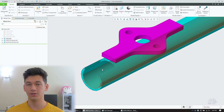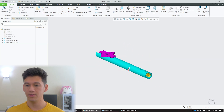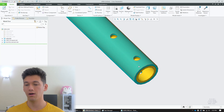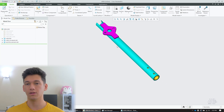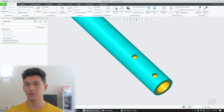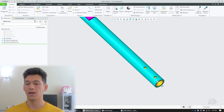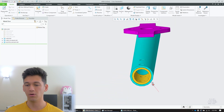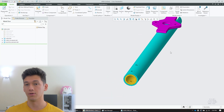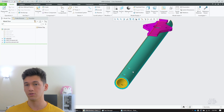The reason for this notch is so that there is some actual structure protruding past the motor wires to protect them. Looking at the other side of the arm, you can see this yellow tube, which is essentially a doubler. This doubler adds material around the holes where the arm interfaces with the rest of the fuselage, because as you move further inwards the moment increases and stresses also increase. There are additional stress concentrations around these two holes since all the load must go through them into the screws. This doubler is only about 30 millimeters long, adding material only where stresses are high to keep the weight down.